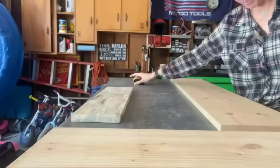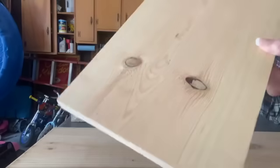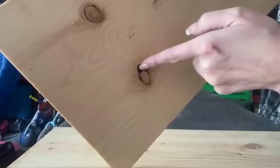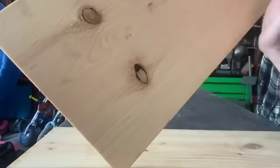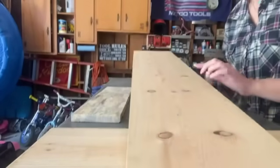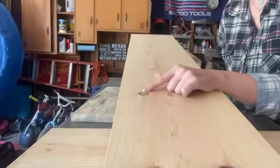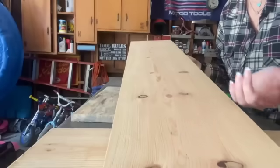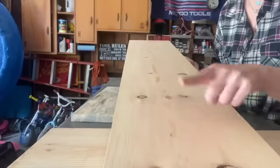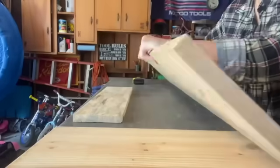We're going to use this 1x10. I don't know if you can see, but that's totally a hole. I could fit my whole nail in there. But you know what? Your girl's got to work with what she's got because wood is getting more expensive and harder to come by. And this one has a couple of knots in it. When you paint over knots, you're going to have bleeds, because if your stencil is going over that and you're trying to paint, the paint is going to go right into those little grooves and you're going to have bleeds everywhere.